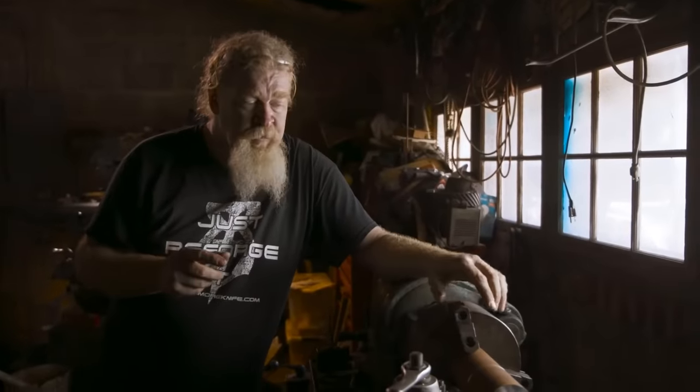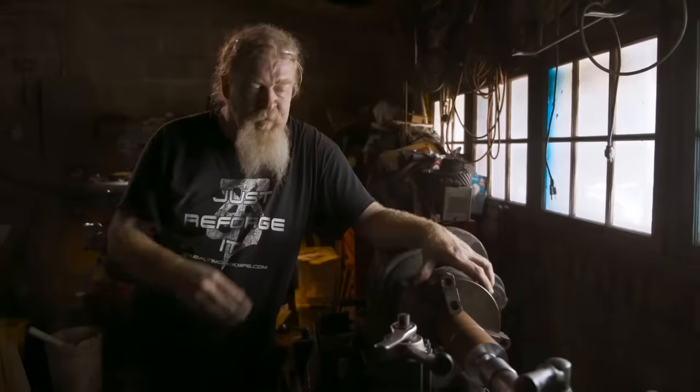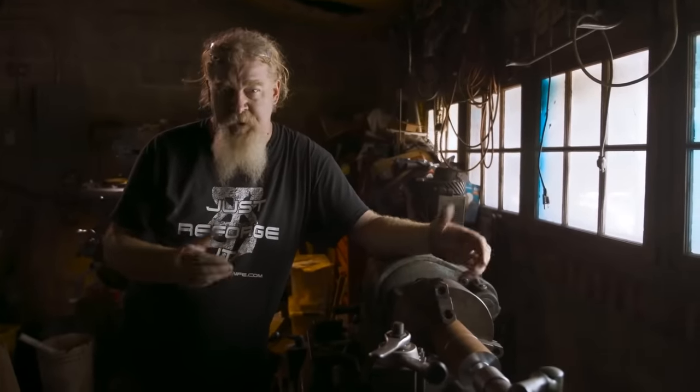The guard for this handle, there's actually a large flange on the top and bottom of it. They could be made as one piece and then the guard set in. I'm going to do two separate pieces because Ilya wants a hole in the guard where the handle goes through, so I'll have a top and bottom flange. But I'll turn them together so that I know that they're roughly the right shape and they pretty much match.